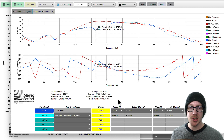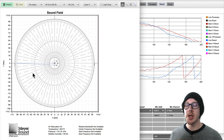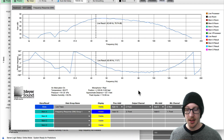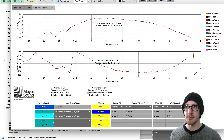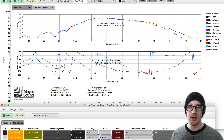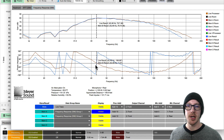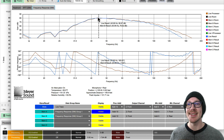The only other optimization I haven't touched on yet is the level setting. I did the level setting from the rear since that's where I wanted to optimize the cancellation. Measuring the rear sub from the rear, storing that, then measuring the front subs — looking at level — that's where I got the level offset of minus 8 dB. Because when these arrive 180 degrees out of phase in the rear, over at 45 hertz I want them to arrive at the same level as well. Matching level — not matching phase — is how you create cancellation.